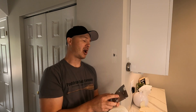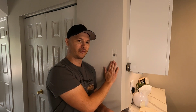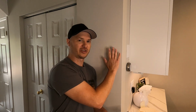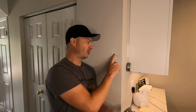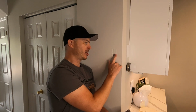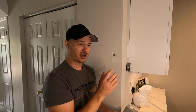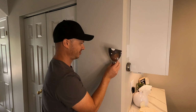And this stuff works really well. I find the problem with this is you get a little bit of lift off. The first coat I find I need to put on very tight just to hold it in place, and then you can do your next coat. The other problem is this stuff has a tendency to crack. So if you don't get this really good and solid, you may have a crack. This also, it's okay for this size of hole because it does cover both sides about a half inch, which is about the minimum you'd want to do, but there is another tape you can use.